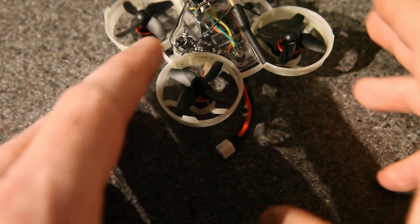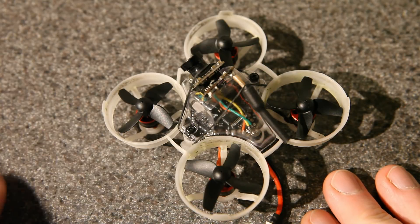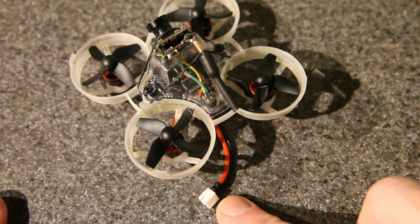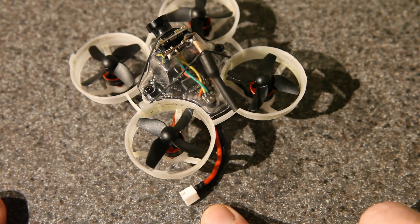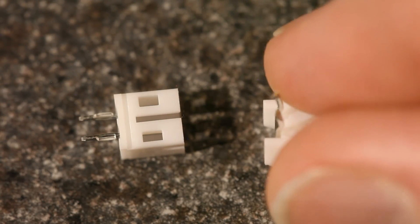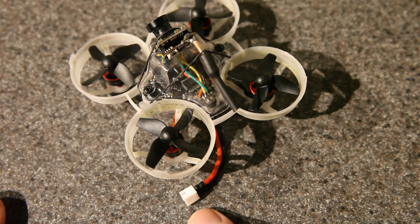So if you're happy with your build and you don't feel like there's a problem with voltage sag, then that's awesome — just go out and fly. But if voltage sag is getting in your way, you might want to consider replacing the connector on your pigtail. There are lots of different versions of this connector out there, so the only one I recommend is the official one designed and manufactured by JST. I get those from DigiKey — they come in a straight pin version and a 90-degree version, with links in the description below. They're super cheap, so just get a bunch of them and share them with your friends.